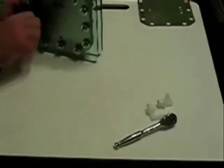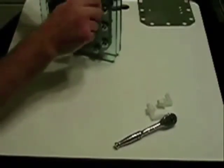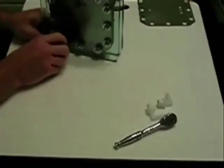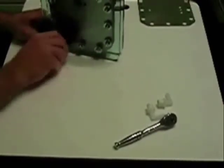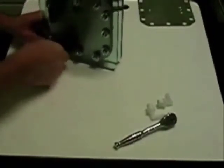You don't ever want to over-tighten this material for a gasket or any other gasket material, as you're liable to damage the gasket. Believe me, that's nothing you want — having to fill these things up with electrolyte and then go back and tear it all apart to repair a small problem with the gasket.